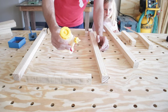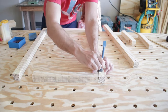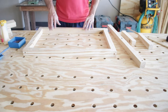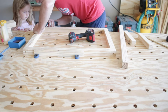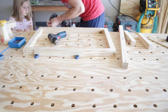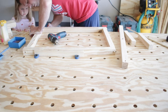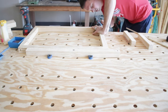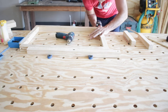The first step of the assembly was to make the rectangle — I glued up both sides and then oriented it on the table so that I could drill a pilot hole through without splitting any of the wood. I've got one of my little helpers coming in and out to see what I'm up to; it's always fun when my kids are interested in what I'm building. I did a pilot hole and then drilled in a two-inch screw to fasten these together. Really, the glue is going to be doing the work. The important thing is to keep them lined up so that everything is square, resembling that tubular look of metal legs.